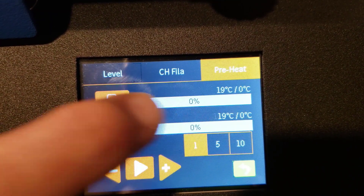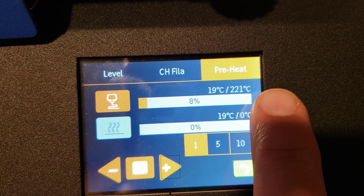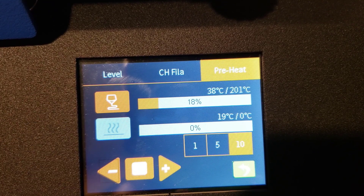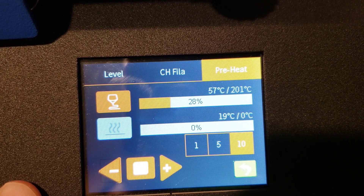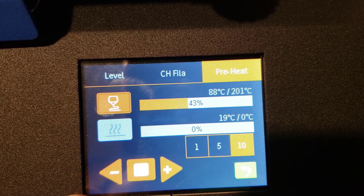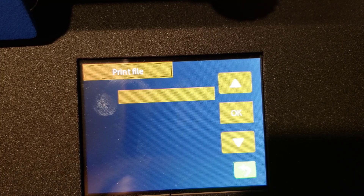Let's check the Prepare tab — you can see if I hit one degree and a single plus, it goes to 221, which is way higher than I normally print. I would not print much from this control panel anyway. I would have it in Cura set at 205, and then you would see it actually happen. I use 200 or 205 when working with PLA. But there is nowhere I can find to adjust this default — I've clicked all over the place and there's no place to type a number or set what that default is in this firmware.